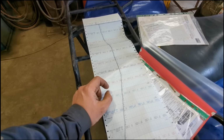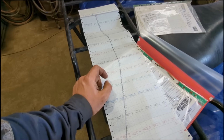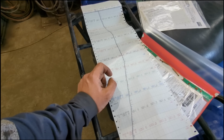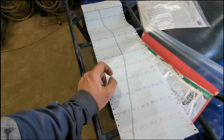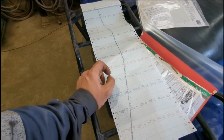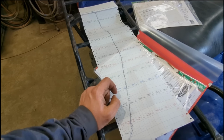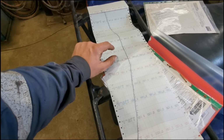You can make a calculation if you're good at maths, an electrician or whatever. The power units, from what I could observe, were 50 kVA each. I think there was 3 in use, possibly 2. So call it 150 kVA. It's taken 150 kVA of power, nearly 5 hours, to bring that up to 600 degrees.